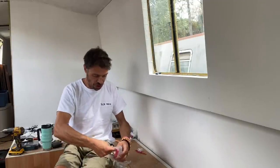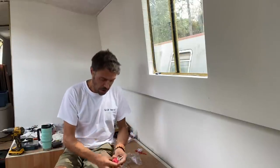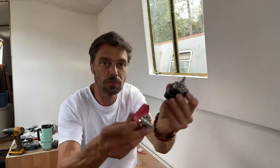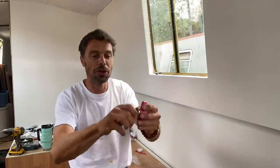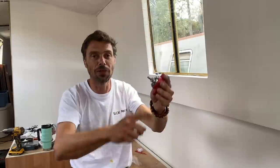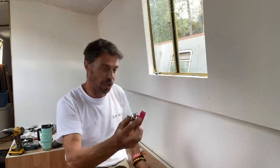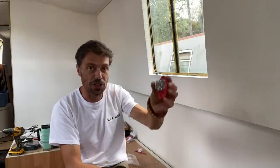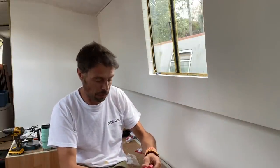And what it's going to do, it's going to go into these two kind of distribution points. So positive and negative, one of those. That's those two. So positive will come on, it'll clamp onto there. From here, I'll obviously be able to put in the little one for the toilet, but then it'll take the other big chunky cable from that point there up to the bow. And obviously gives me a few other connections that I can do other things with if I needed to, if I want some 12 volt in the bathroom or anything.